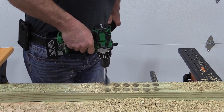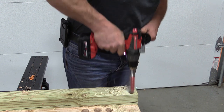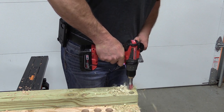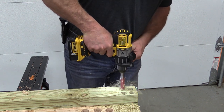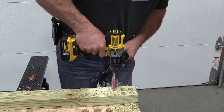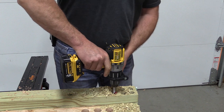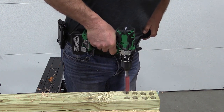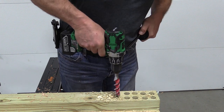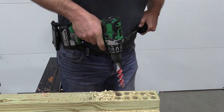Next we used a one inch auger bit. We did a lot of testing in high speed mode and found that pushing all the way through the wood would gum up the self-feed portion and skew the testing, so we drilled to a set depth and pulled out. Milwaukee had zero issues in high speed — very comfortable. The DeWalt's first two holes were great, but the last hole stalled out. The Hitachi had zero issues and performed well. So the Milwaukee and Hitachi went through without stalling, with the DeWalt having one stall out.